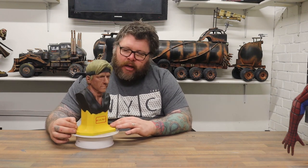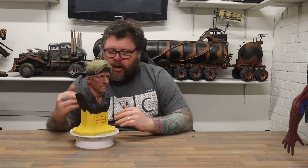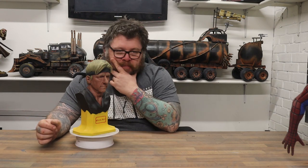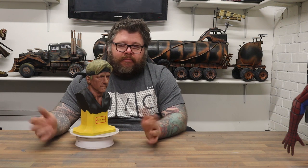As I say, it printed really well, maybe a couple too many layer lines visible on the face for me with this print. We've since switched our printer profiles from Simplify 3D to Cura and we have noticed a remarkable difference with the print quality. Just the tree support setting alone on Cura makes it worth it.